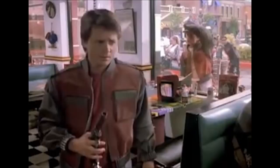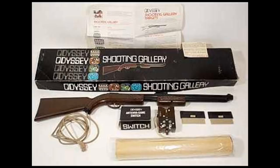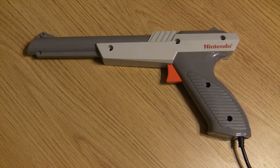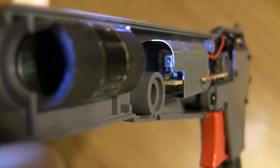By the 80s, Nintendo released their first hit home console, the Famicom, or NES outside of Japan. A light gun accessory seemed a natural fit, though the idea of bringing this into the home was not new. In fact, the very first home console, the Magnavox Odyssey, also had a light rifle peripheral — and one of the most badass looking ones at that. Compared to other light gun technologies of the 80s and 90s, which used fancy techniques like timing the scan lines of your television, the Zapper was relatively simple in its approach. It sensed light via a photodiode, the grandson of light-sensing vacuum tubes from the 30s.